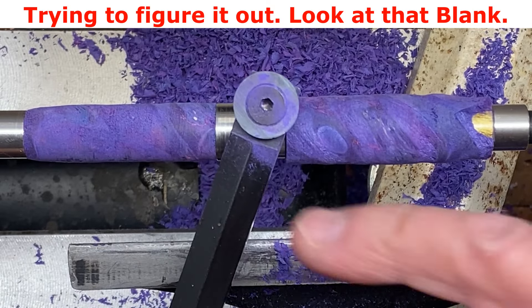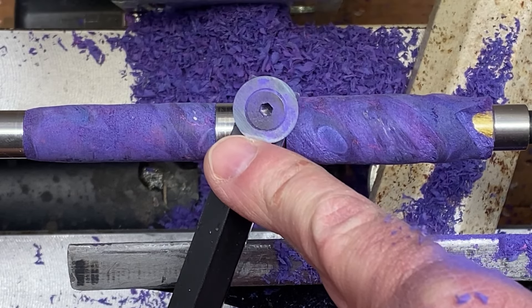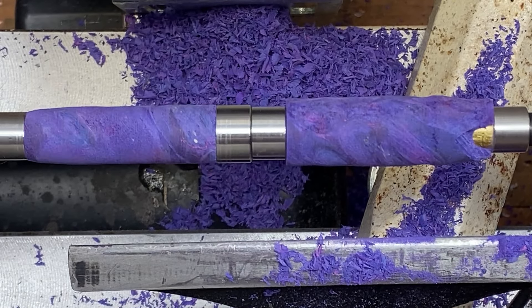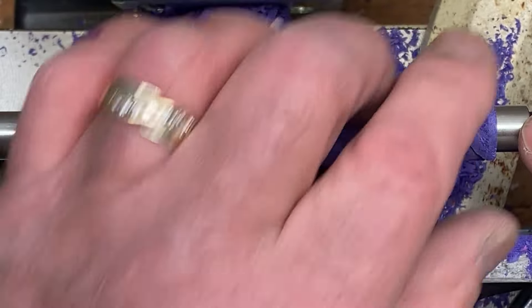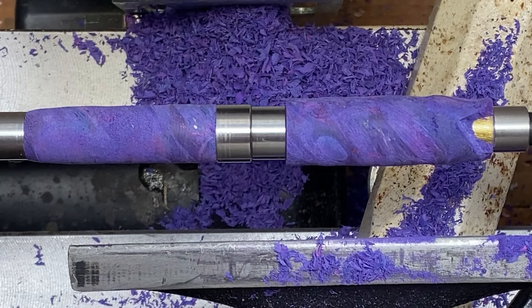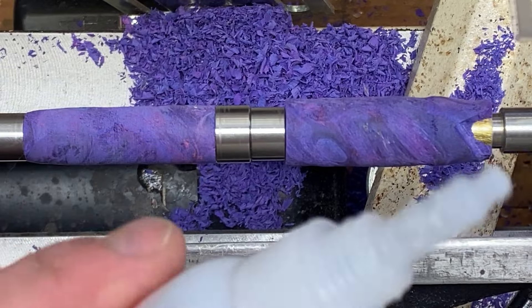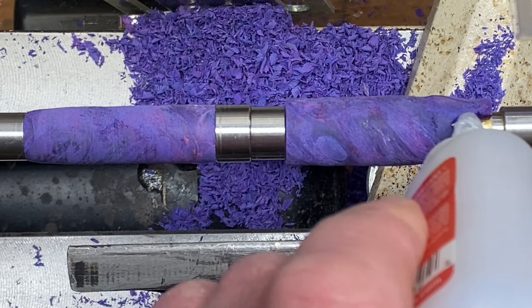I'm having a really hard time with my carbide cutter — it's dragging really bad. I stopped once and rotated it, but I can see some chips, so I'm wondering if this cutter has been rotated multiple times and it's shot. I think I'm going to have to replace it. I ended up tearing out a little section at the end of the blank — not a big deal. Luckily I caught it and it stayed in one nice big chunk. We're going to get that glued back in there, and then I'm going to grab my skew. We'll finish turning with the skew. For these type of repairs, you really want to use medium CA as opposed to thin, because the thin is going to run everywhere and just make a big mess.